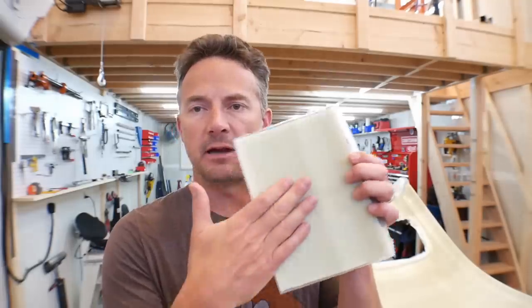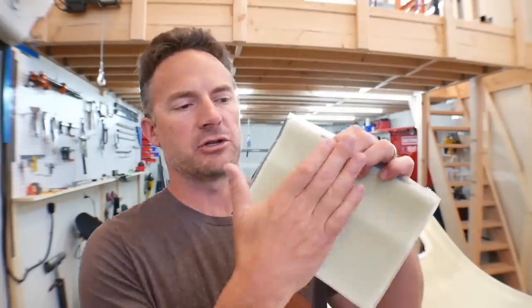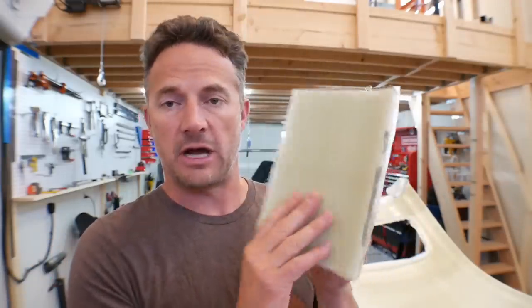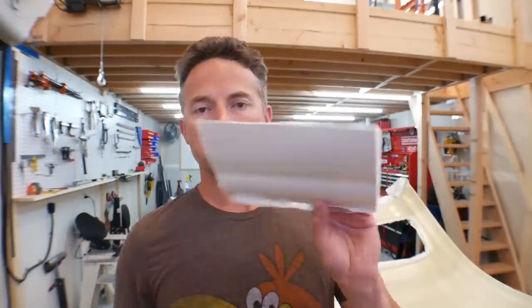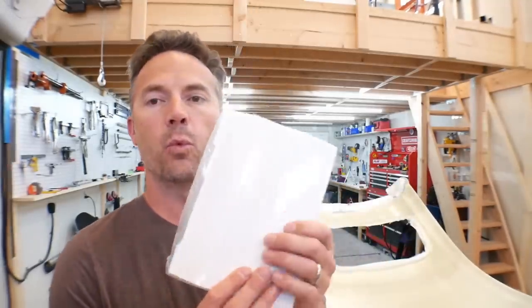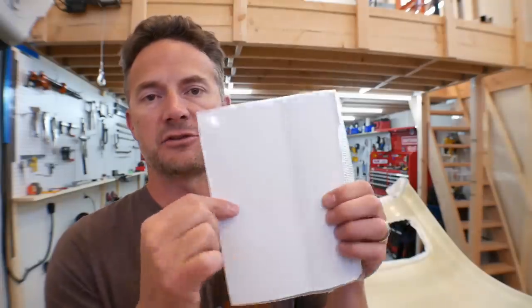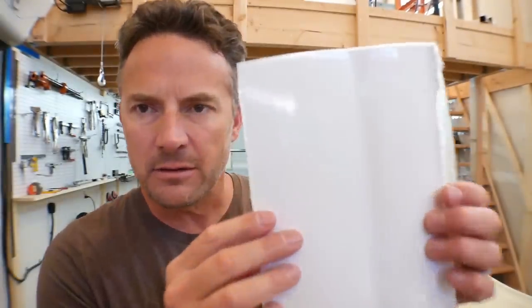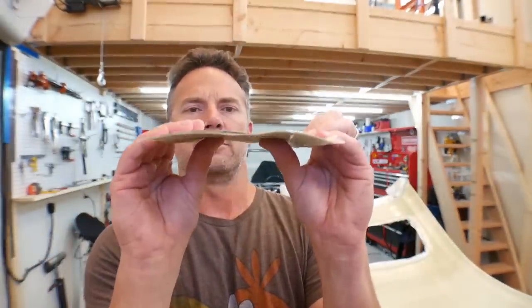I put PVA on it, brushed white gel coat onto it, and then I put three layers of epoxy resin on here with the cloth — the same cloth I used on the mold. I did interweave it in two different directions, cross-patterning the fiberglass, based on comments I received. Then I separated the two. This is what I'm hoping the actual roof piece will come out as — three layers, interwoven, with two layers of gel coat. It came out pretty darn good, and it's also really strong.